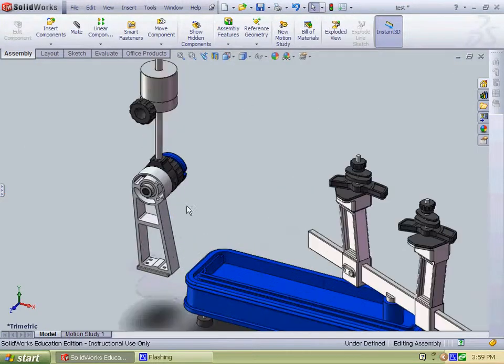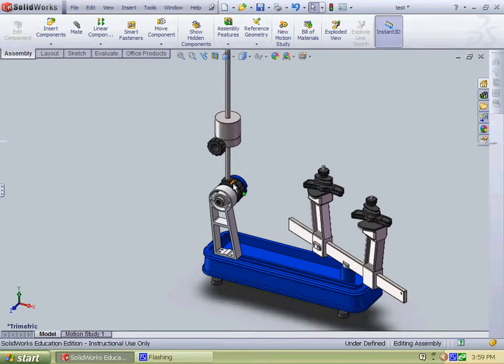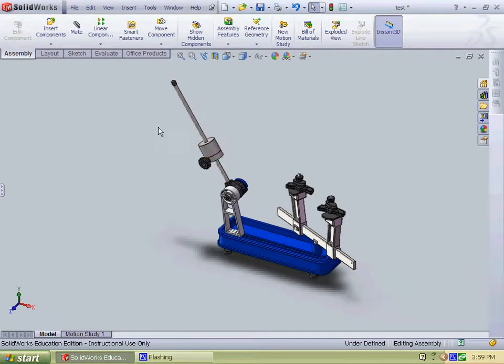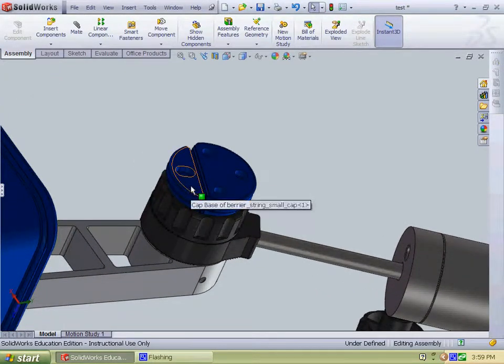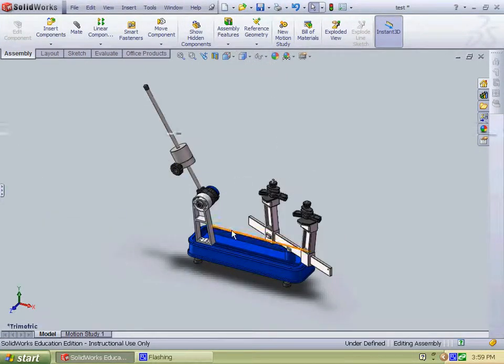They would hold the winder stand in place, and on the winder stand there are these bearings which will allow the weight bar to rotate. On the weight bar there's a weight which can be bolted, twisted into place, tightened for the specific tension needed. And down here the blue part, the string would come around, go through this midsection, and the blue part on the bottom will move out, and then you push it back in with your thumb, and then use your other hand for fine adjustment using this knob and gravity, and you get the required tension you need.